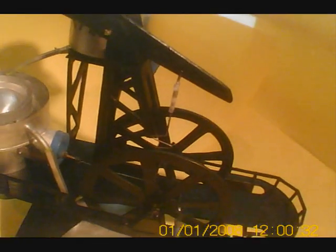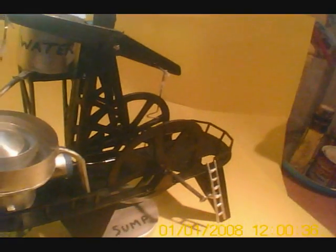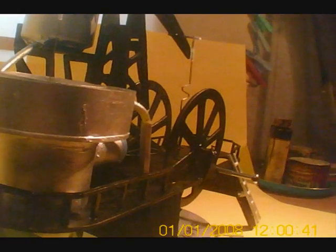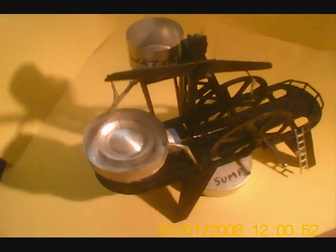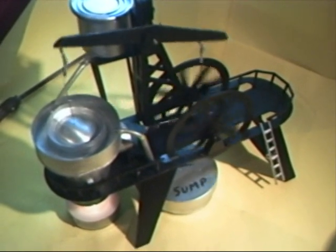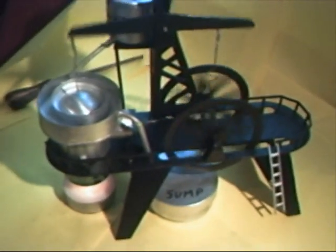I built it. It's a little project that I just enjoyed making — all the woodwork really. I've got a little water tank, a little water feed that drips down into the tray. You don't always have to use that; it runs just as well without the water. I made the tin can engine and I made the displacer roughly twice the size of the can, with about a quarter of an inch top and bottom so it can move its full length.